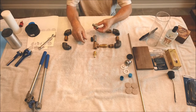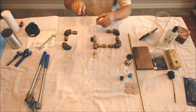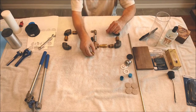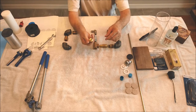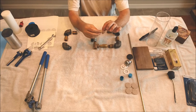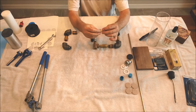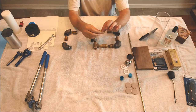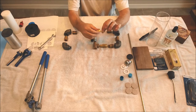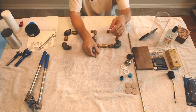This is the other Swagelok fitting. It's going to go down and loop around to the back of that glass vase. This is the little hose barb. I think I talked about this earlier. I'm going to machine those little ridges off of there. This is made to bite into your tubing when you're putting a tubing and a hose clamp on here. But I kind of want it to be smooth, so I'm going to chuck this up in the lathe, and I'm just going to turn those off of there and make it a nice little smooth bore.